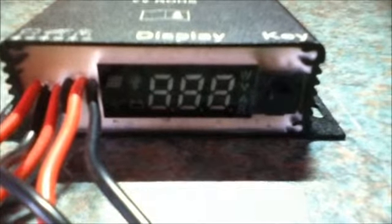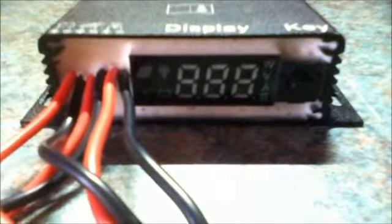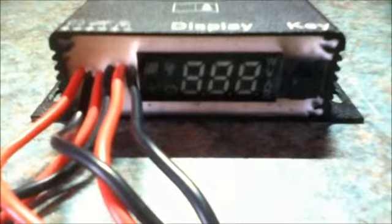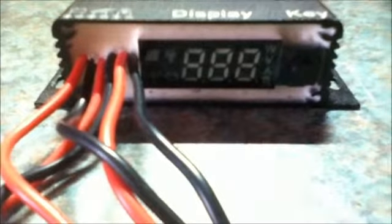On the front it has an LED numeric display, and this one can show you the wattage coming in from the panels, the current from the panels, the battery voltage, and the load current, as this controller has a load output. It features a timer which can turn devices on and off after sundown, so for a night light system, for example.